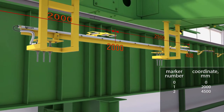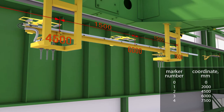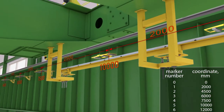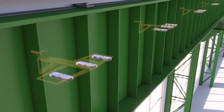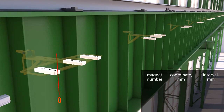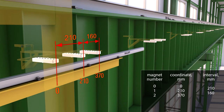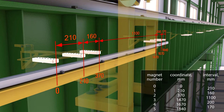The interval adaptive marker system operates sequentially: first it identifies a marker, then it calculates the distance between the adjacent markers, thus creating the interval markers track. The MagneTrack Super Adaptive Positioning System has no information about the configuration of the magnetic marking. Its operation relies only on a chain of single magnets, which can be installed both as interval as well as positioning markers — i.e., separate magnets.